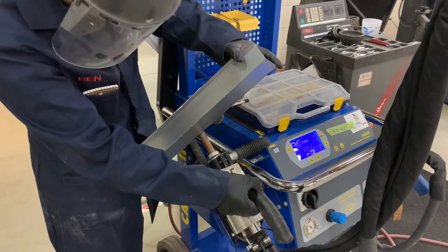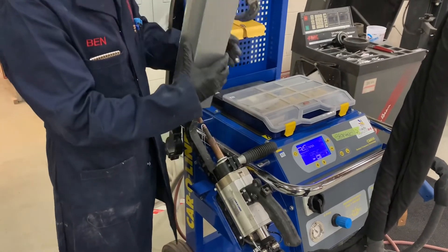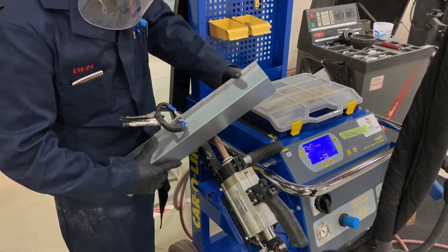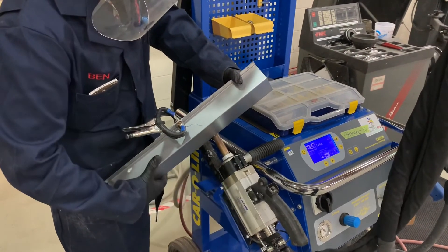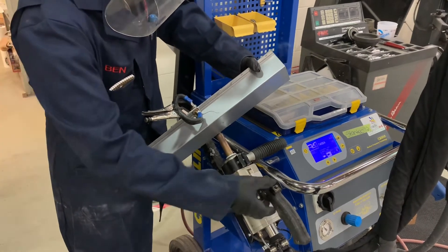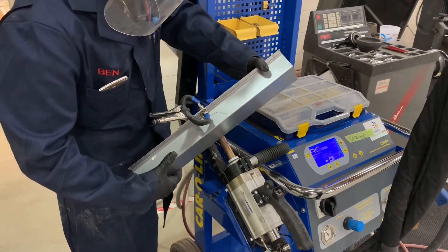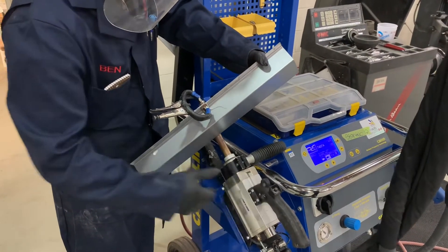When performing the weld bonding and weld sealing processes, you may notice a slight difference in your welder setup. You may need the heat, temperature, or time increased, and your machine may have a setting specifically for these parameters. In any case, always do a destructive test. If you are doing weld bonding or weld sealing, your destructive test must include the particular adhesive that you are using. You'll also notice there may be a little bit of smoke or slightly more sparking with this process, but if you have excess sparking there's probably a problem with your welding process.